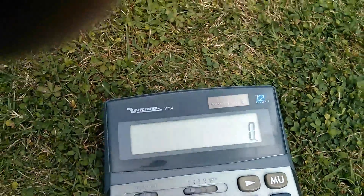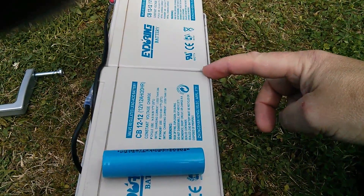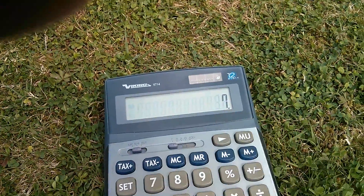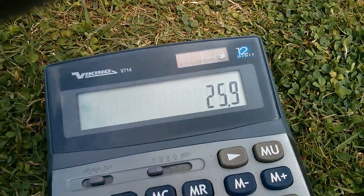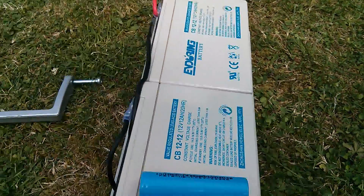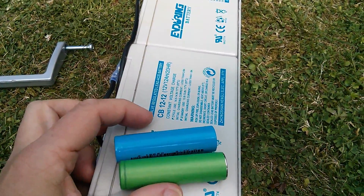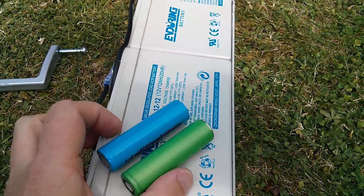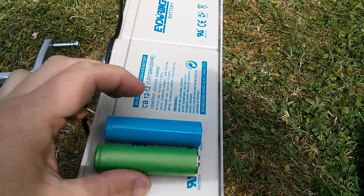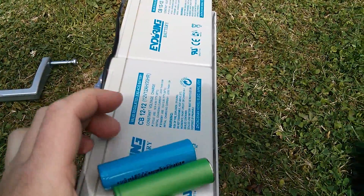This 24-volt battery when fully charged is probably more like 25 or even 26 volts. Lithium at 3.7 volts times seven gives 25.9 volts, so in terms of voltage it's a pretty good match. The lithium cells should behave like a very well-charged lead-acid, and their voltage drop-off would probably be better too — just better performance all around, and of course it should be lighter.